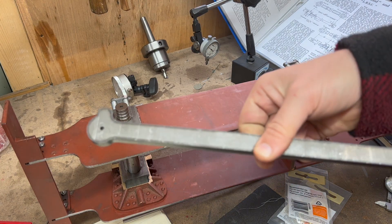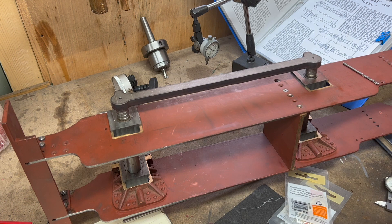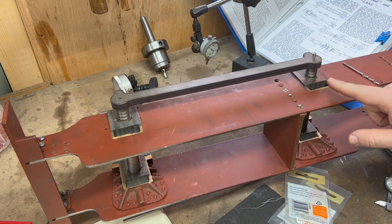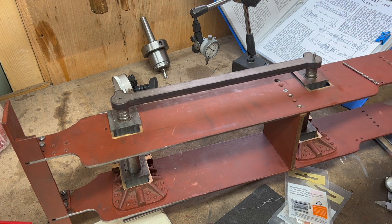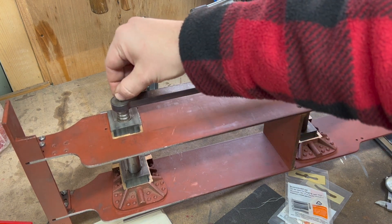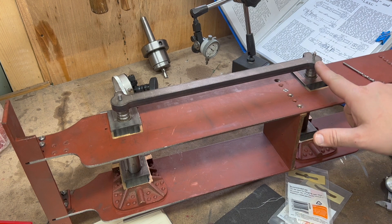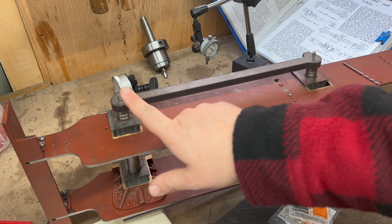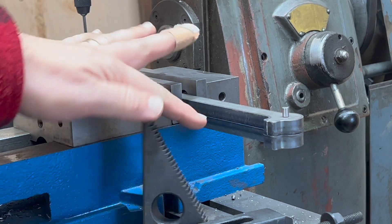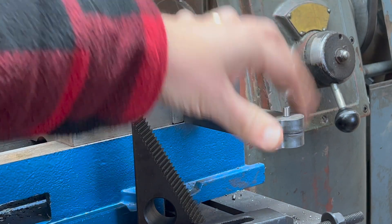Here is the chassis laying on its side and here's the coupling rod with those two holes I've just drilled. If I place a pin in this hole to align it to the center — and that's why we drill the 60-degree angle on there, to match the center hole in the end of the axle — then we have a second pin. We drop that over here and you can see it drops really nicely straight into the end of the axle. So now we know these are the exact center distances of the two axles. Having drilled one hole on the other axle, I can now mount them together and drill through the second. And there we go — here are the two coupling rods with that alignment pin down the middle of the two holes.